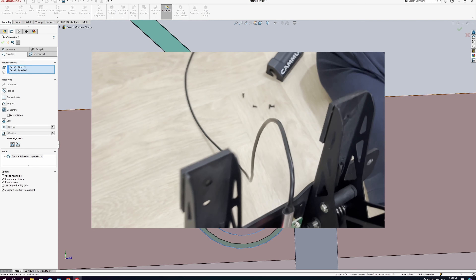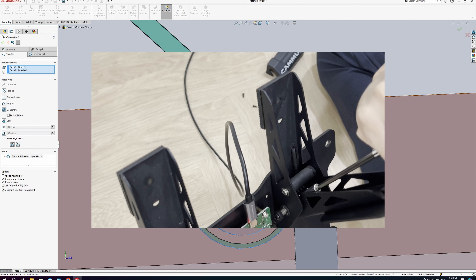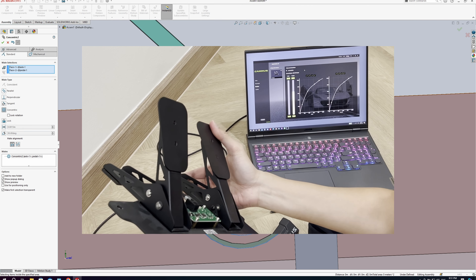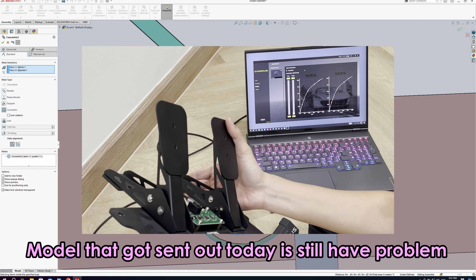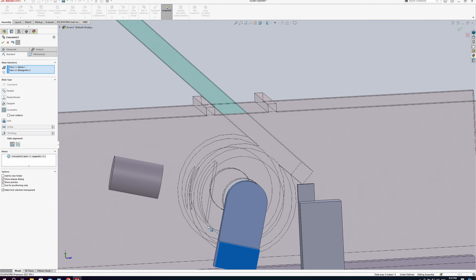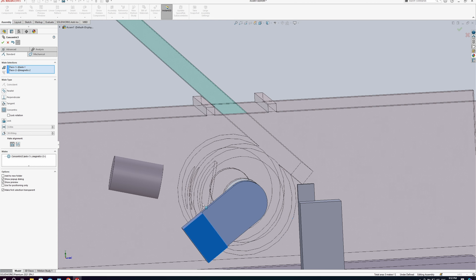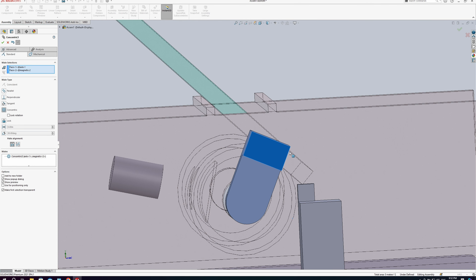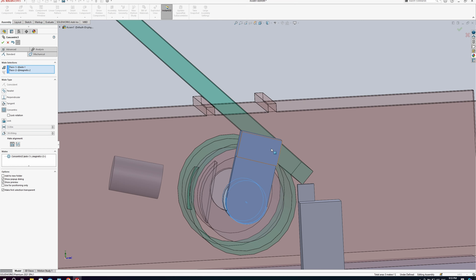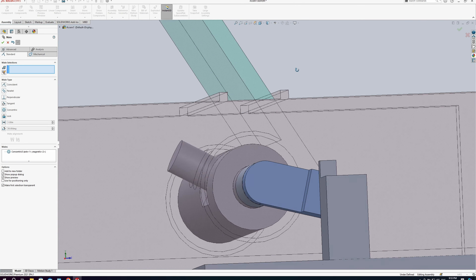After the fix you get super high resolution and all the problems are solved. Sadly, this is a very common problem in almost all CP5 units — I don't think Cammus's quality control is good enough to catch this small detail. Cammus needs to improve their QC, or at the very least stop gluing the magnet to the axle and let users adjust the magnet position themselves. That way users can just move it to where they like, screw it down, and the CP5 would be a perfect pedal at a super cheap price.